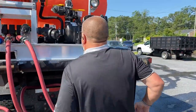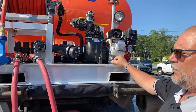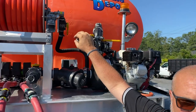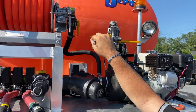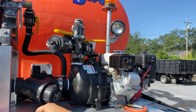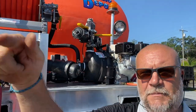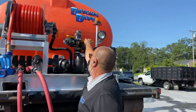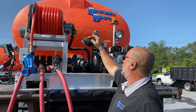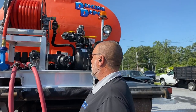So we've ended our day — we have probably 600 gallons of brine in here. You don't want to pick that up with your forklift; you want to empty it off. Attach your storage tank hose here, rotate the handle, and close your back pressure valve. Fire up the motor and everything in that tank will come through and back out to your storage tank. Once you're done, put a crack in your back pressure valve, close the handle, disconnect the hose, put your plug back in, and relock everything down.